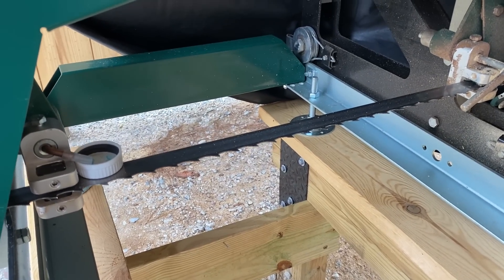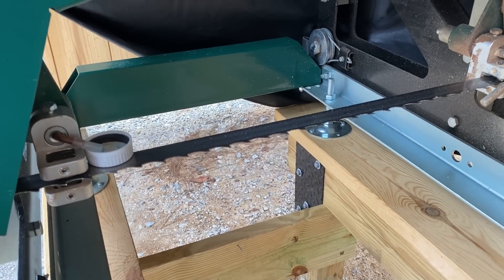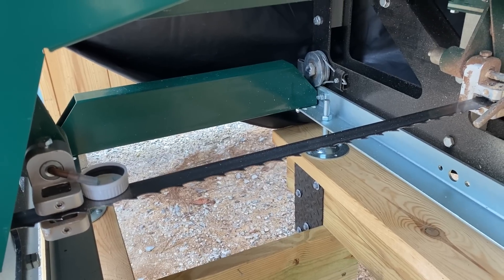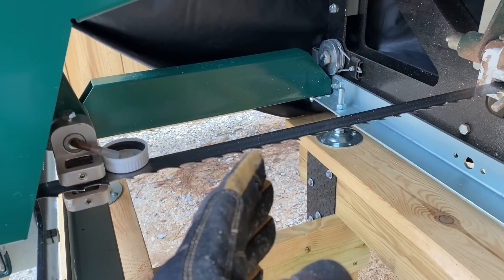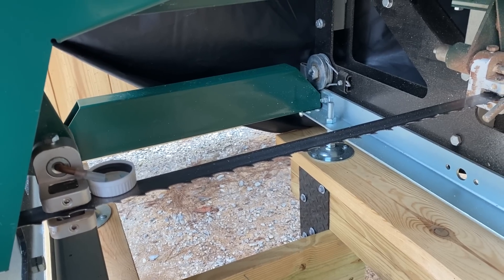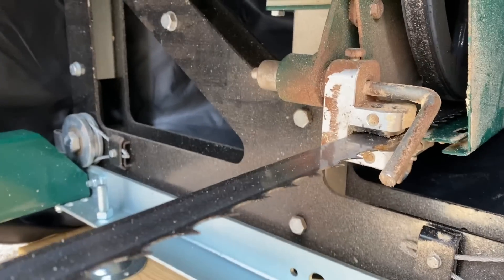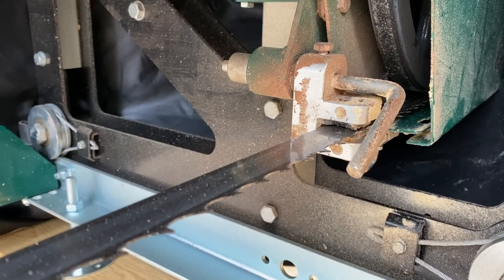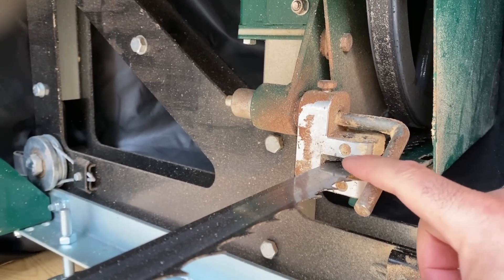I've shown you all those other pieces of wood I've cut without an adjustable blade guide, which means I've got basically a 22-inch blade just sitting out there, and I got very smooth lumber — except for that occasional chatter on the end of a thin board. An adjustable blade guide can help, but my results show it's not absolutely necessary if you've got everything else correct. It's important to have these guides set right. Woodland Mills uses fixed blade guides — essentially hardened steel bushings inside a block, held in with set screws. You need to carefully set the gap between the bushing and the blade.